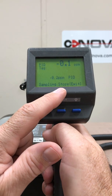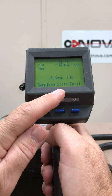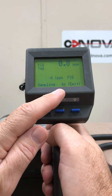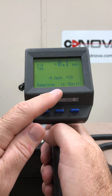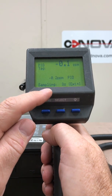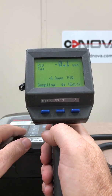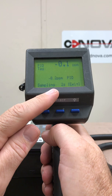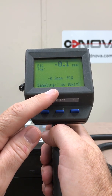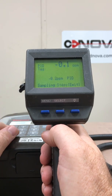You can see down here that it's counting down every five seconds and storing a sample — the display shows 'store, four, three, two, one, store.' I've set it to store every five seconds, meaning it takes a reading every five seconds and stores it in the memory on this TVA 2020. You can set it for 30 seconds, one minute, two minutes, one hour — easily selectable, done through the setup menu on this TVA 2020.